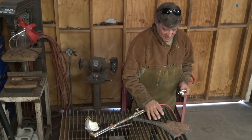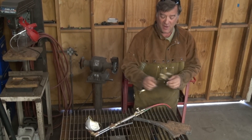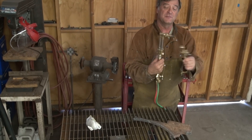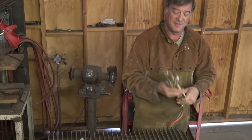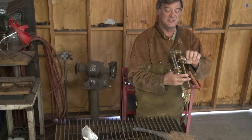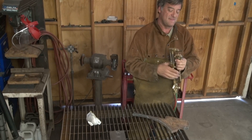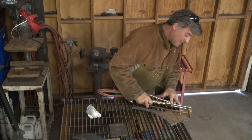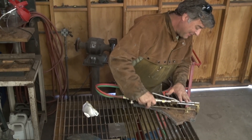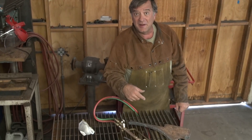So I put my cutting table up and I've got just a piece of 1-inch plate. I'll go ahead and put it on the torch, click it in place, and then I can adjust my radius with the little roller. Lock it in place. I like to check it because I've cut things off too short way too many times. That will work just fine. Let me put my gear on and we'll fire it up.